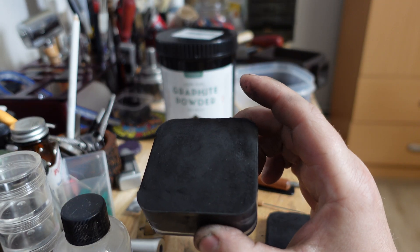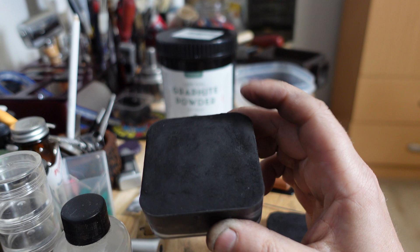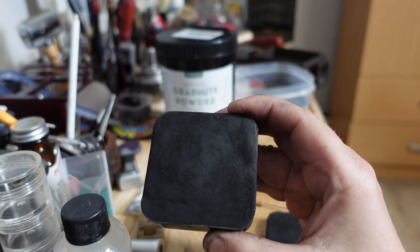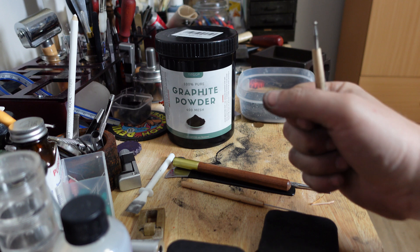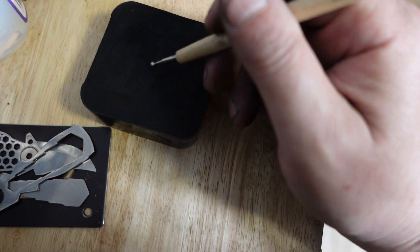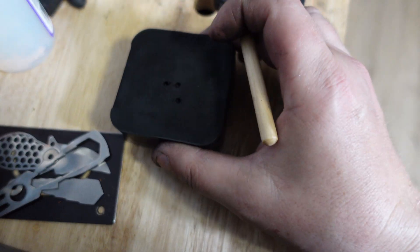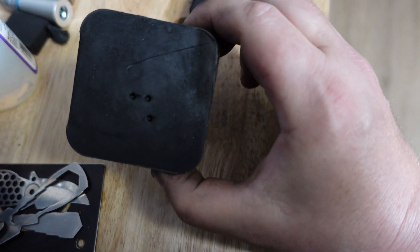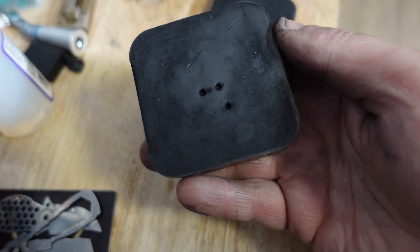It has become — because it has a much stronger plasticizer in it — more like play-doh or polymer clay. That's how this material behaves. Like regular sand casting material, when you compress it you can imprint an image, but only so far. This material holds the smallest detail permanently — well, not permanently, you can rub it out. But you can carve in the smallest details and they don't go away, because it's very hard. It's not fragile like casting sand is.